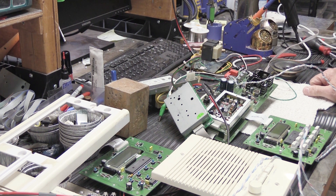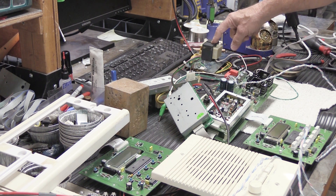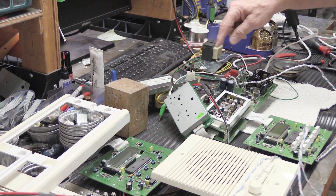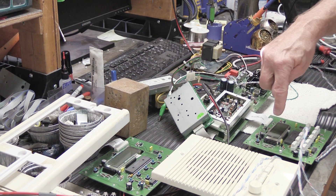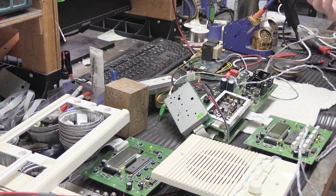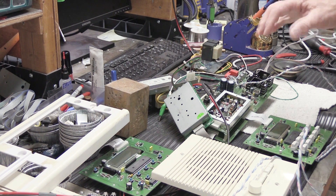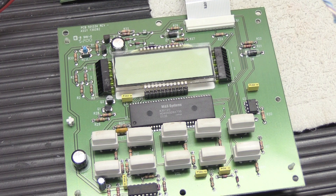Once powered up it plays and everything seems to work correctly. The things I need to do today are: replace the fuse in his transformer, see if his tuner module is repairable, install the replacement microprocessor board, put it all back together, and at the end it should work. We've already proven with this setup that it will work, so it's just a matter of doing the repair work and reassembling.